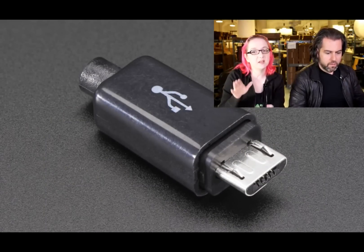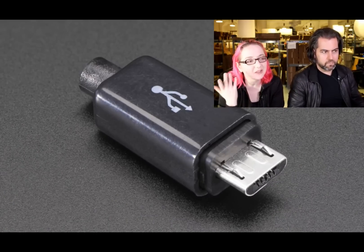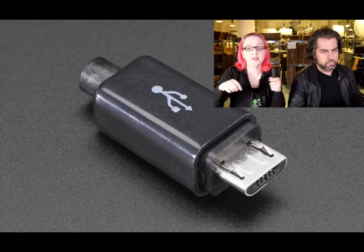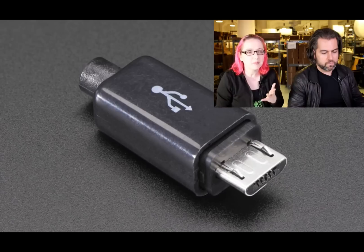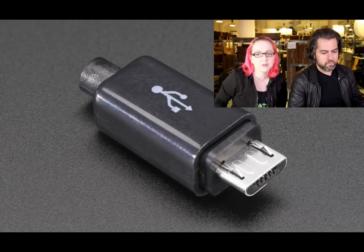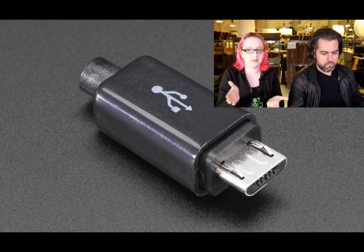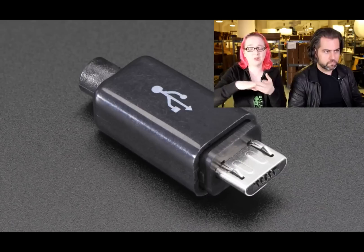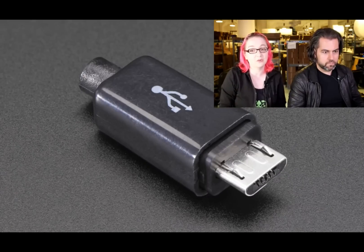We already have these in a two-piece snapped-together style. These are slim style — a little tougher to use because they press-fit in, but they're more elegant and less likely to come apart. These are a little more durable, and slimmer, but tougher to use because you have to solder the wires and instead of a sandwich it slides in from the end. Once you put it together, it's really hard to undo.